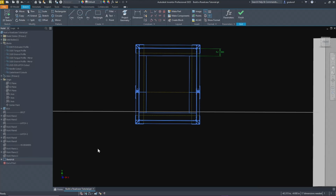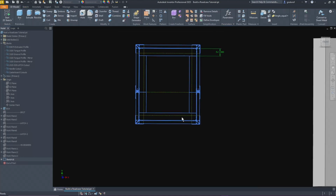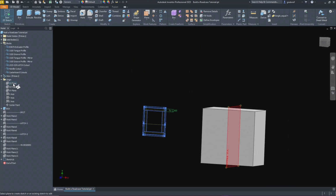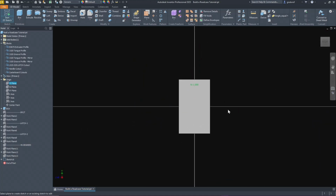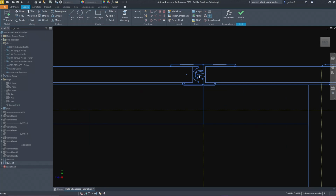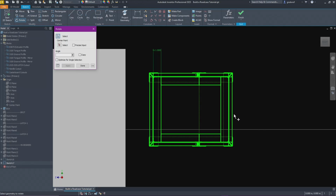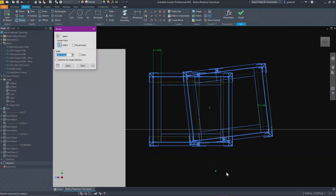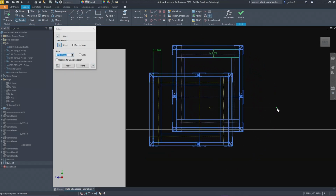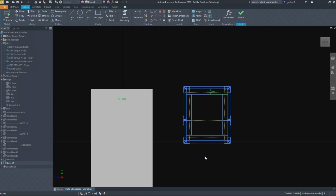So before we get out of this, we're going to select this, copy it, Control C, get out of here. We're going to do sketch, and this time we're going to do the side. So we're going to take this profile, paste that. It's going to come in a different orientation. Just make sure that your tongue of the tongue and groove is actually pointed in the right direction. Let's select that and rotate it into place. On our center point, it's going to give you some guff because it's seeing it as constraints. The constraints are in horizontal and vertical in the other direction. Not a problem.